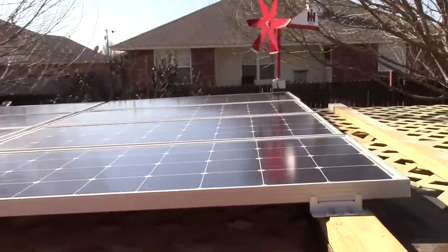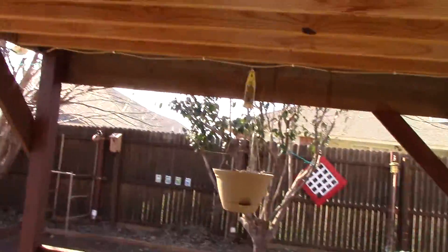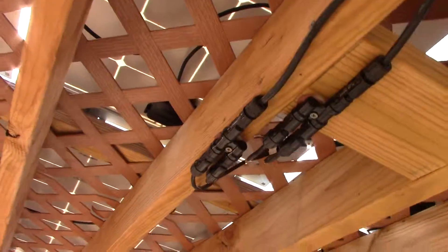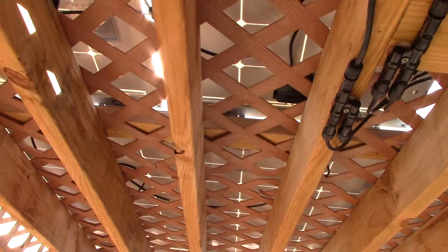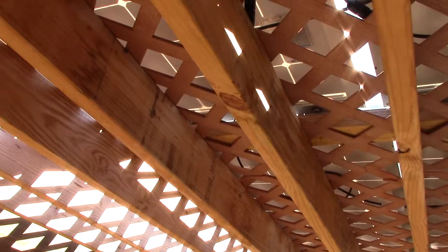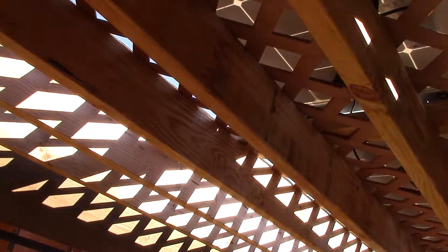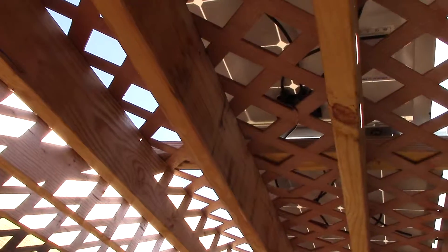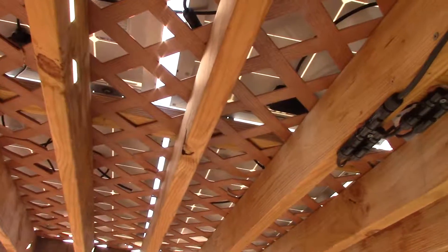Let me step down here and I'll show you underneath. Much better job with the wiring — I got it wired series-series-parallel. I put new cross connectors in here last year, a marine buddy and I did that, and it turned out really good. Got these wired series-series-parallel in a 48-volt system.